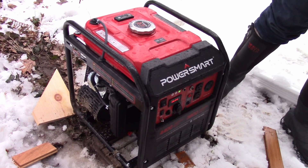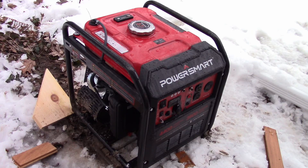First pull. Just in case you don't want to watch the whole video: it kept dying when I was applying a 3,000-watt load to it. Turns out the oil level was low. Even though I filled to the H on the dipstick, after running it for a while it actually went down. The oil that came out of it was really black, so take that for what you will.